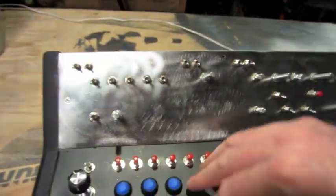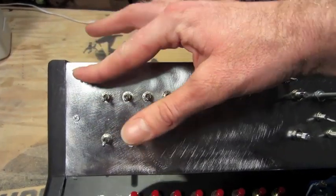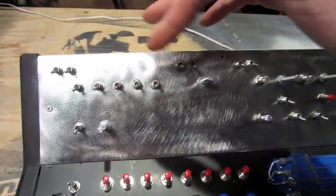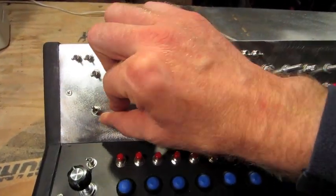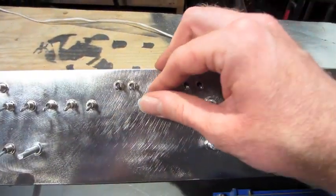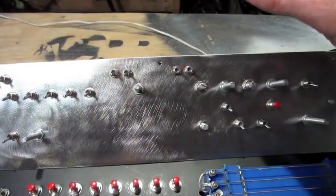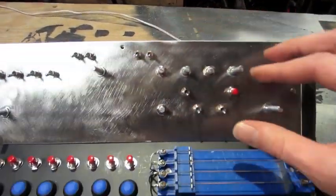And then the audio from there goes out to a voice changer. The double toggle switch acts as a bypass, so it sends it through the voice changer when it's up. When it's down, it just bypasses through the next one. Different voices there, pitch on, and adjust the pitch, or when it's down, just a stock pitch. Into the tape distortion, same thing, the double toggle bypasses it. Adjustment for the distortion, and then into the delay, same thing, bypass.